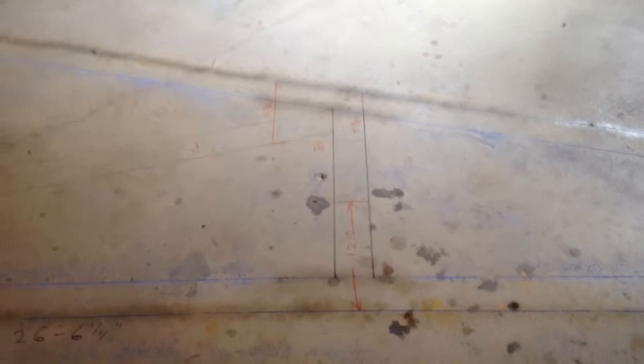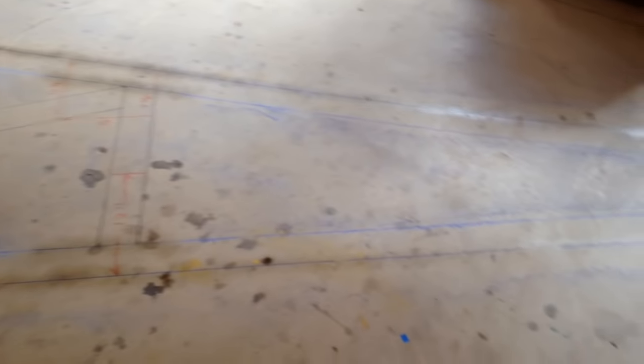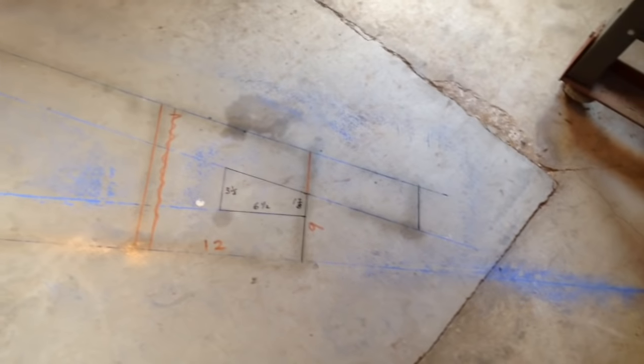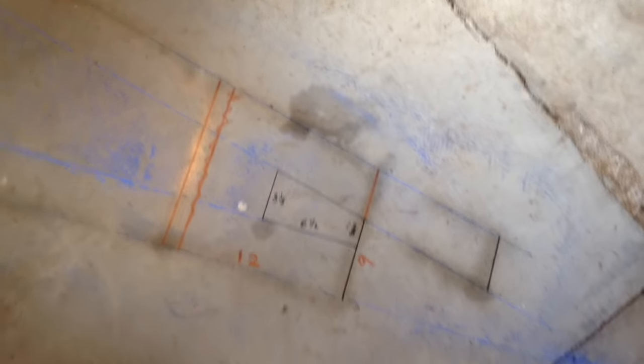This truss would be in the $75 range if I had to buy it already built, and then the delivery fees would add to that. I'm able to buy the lumber for about $25 and some glue, some nails, some plywood for the gussets. The first thing you need to do is do a good accurate layout on a nice, somewhat level and in-plane surface. I've done that and when I got done I locked it down with some clear lacquer — that's still drying — so that I don't lose these dimensions and marks and all the work that I've done.